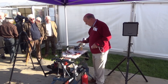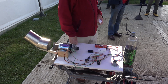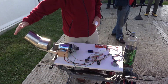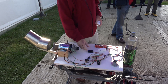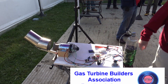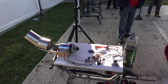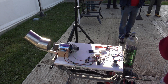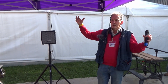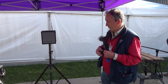These engines, especially the turbojets, waste a lot of energy to atmosphere because you've got high temperatures and high velocities basically coming out of the exhaust jet pipe. But as soon as you get involved with a two-stage free power turbine onto a propeller, you keep all that high velocity and high temperature in the machine — not all of it, but a good proportion — and that makes the whole engine much, much more efficient, turning that energy into shaft power to drive a propeller which moves a larger mass of air more slowly and controllably, ideal for the arrangement.